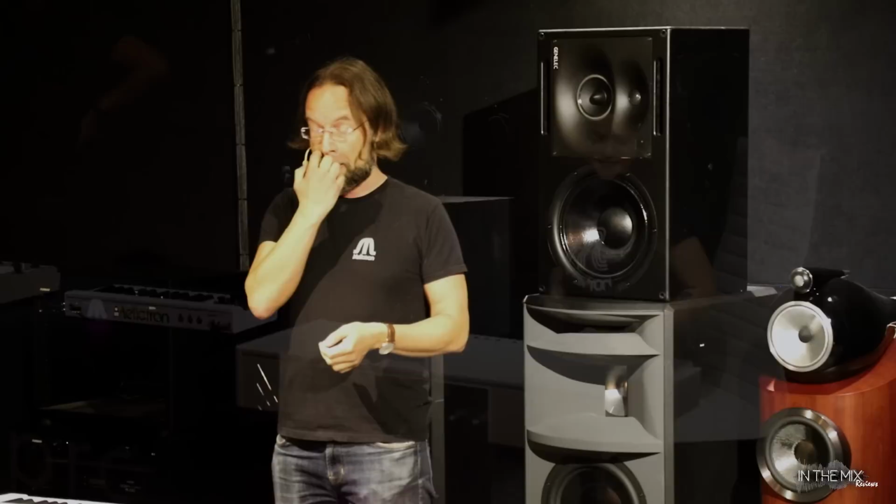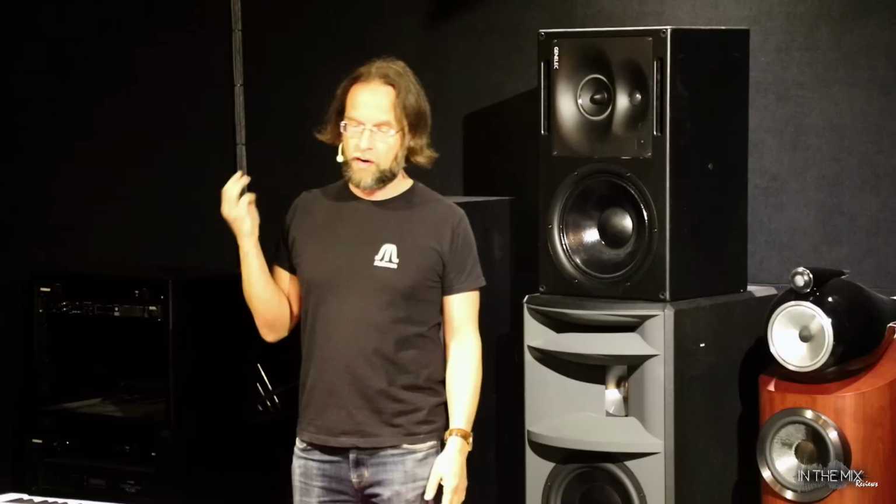But the Mellotron company just continued with the sales of these white instruments of the 400 and had quite some success with it. But they made one big blunder, and that's the motor control to control the capstan motor so that it's constant in speed. It just didn't work well, so it didn't stay in tune over time, and when you pressed many keys, it would go out of tune.